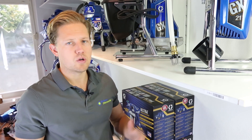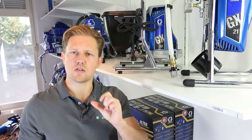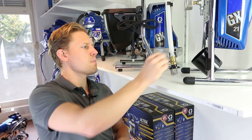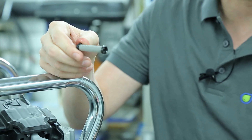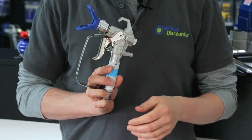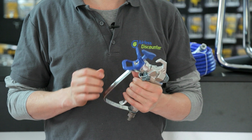Let's compare what you get when you order one of these sprayers. The GXFF comes with a 210 spray tip whereas the GX21 comes with a 515 spray tip. They both have a RackX spray tip holder and both come with hoses, however the GXFF hose is slightly smaller and shorter — you get a 15 metre hose on the GX21 and a 7.5 metre hose on the GXFF. For filters, the GX21 has a main 40 mesh filter and an easy-out 100 mesh filter, while the GXFF has a regular 50 mesh filter. The spray guns are an FTX two-finger trigger gun for the GXFF and an SG3 four-finger spray gun for the GX21.